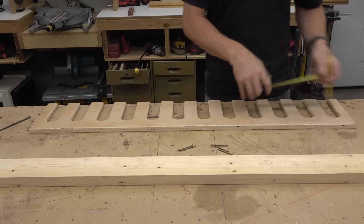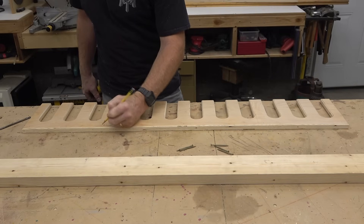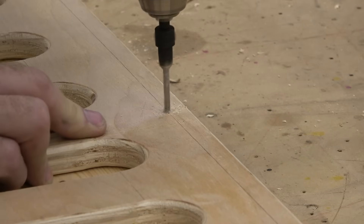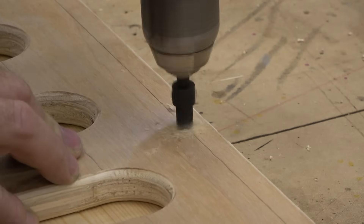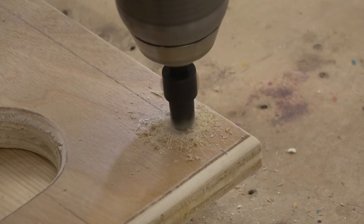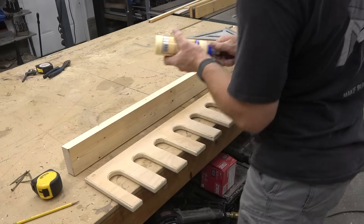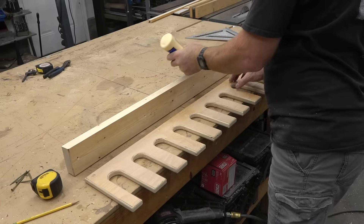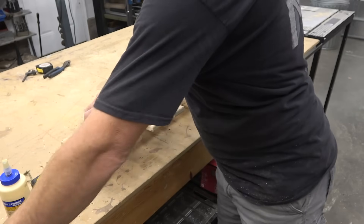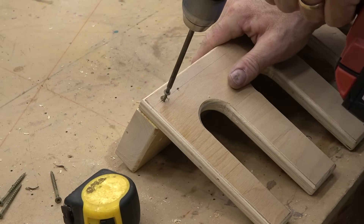Now I'm scribing a line to locate the screws so I can fasten the top to the support member. I divide it into four equal sections, so five screws. I glued this together but I don't think it's necessary — if you were in a hurry you could just fasten this with screws and it would probably do just fine. This is one of my favorite tricks: nail the thing together before you apply the screws, that way it's not slipping all over the place when you install the screws.